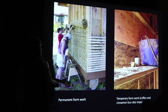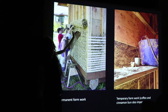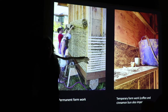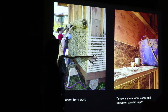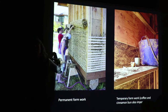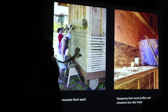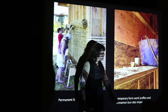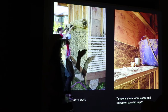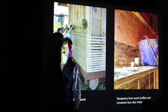The other hallmark of light straw clay is that you're using formwork — either permanent, where a reed mat gets rolled up and stapled in and light straw clay gets poked in from the top, or wood lath, which is little strips of wood stapled on your vertical members. You can pack it in with less density for better insulation quality, and you get a nice substrate for plastering over. Or most people do temporary plywood formwork that just leapfrogs up as you pack the light straw clay in.